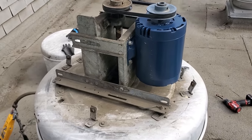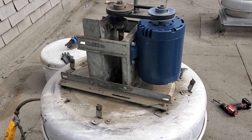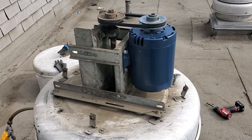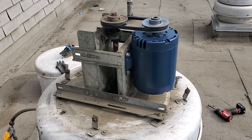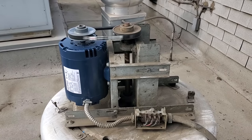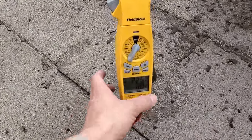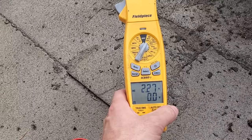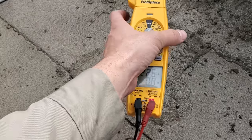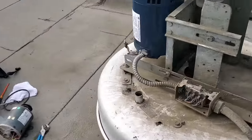You've also got to be careful — I did speed up this exhaust fan, and that is going to negatively impact the building air balance, since this fan is going to put a bigger negative air pressure on the building. After I get this running, I will be talking to the customer about coming back and doing a quick adjustment on their air balance. Got it back on and running — the belt's nice and tight. We're now running at 2.25 to 2.27 amps, so that's much better. I'm going to leave it at that.